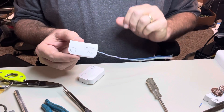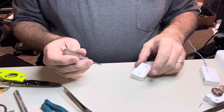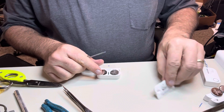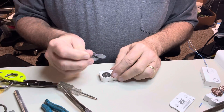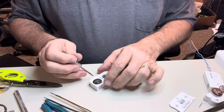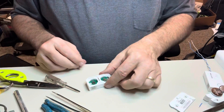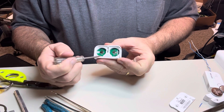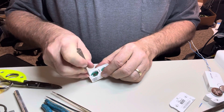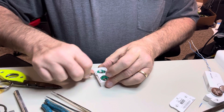This one does work — I've already tested it. First off, we just get rid of the magnet. A few simple tools — I'll describe them as we go. I use just an old cheap flat-blade screwdriver. Get that out of the way, pull the battery tabs out, pull the batteries out — set those aside because they will fly everywhere. Now I need to take this retainer piece out. I've already done two of these, and I found it's easier to start in the middle.